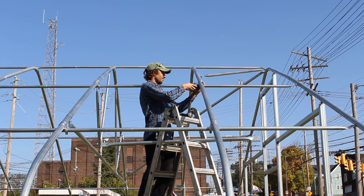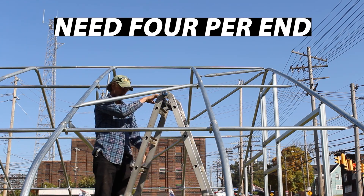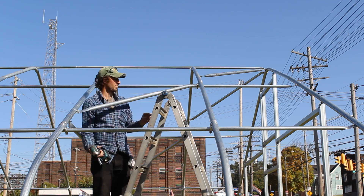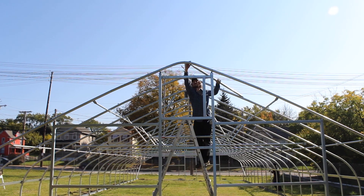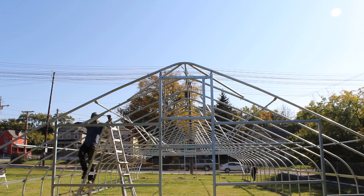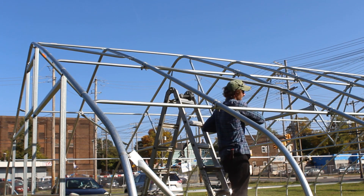The unit we just completed is the third of four that this end will have, so I'm going to quickly complete the fourth one so that this end is completely done. Not all structures will need four per end, but as I said, this is a 30-foot wide structure. Once I finish the fourth and final peak wind brace on this end, I'm going to make my way down to the other end of the structure to repeat the entire process. Hopefully this video shed some light on how you can additionally brace your season extension structures, or gave you an idea of a component you need when looking to purchase a DIY kit. If you found this video helpful, consider subscribing to our channel — thanks for watching.